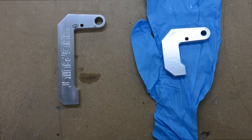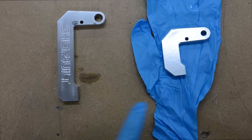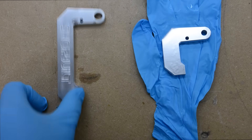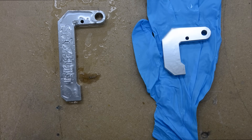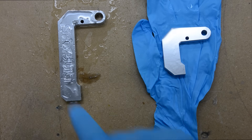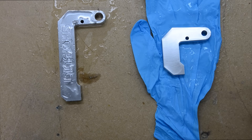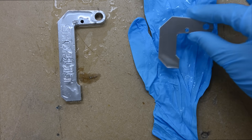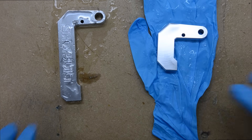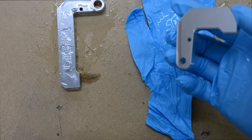Cleanliness is obviously very important, and there's a simple test you can do to make sure you're there. This part here is a dirty part, this one I have cleaned and degreased, and I'm just going to spray it with a bottle of water. Notice how this one kind of bubbles up, but the clean one almost sheets off - that's called the water break test. As long as your part passes this water break test, you are clean enough. All I did to get it to pass was scrub it with a degreaser - just Simple Green.